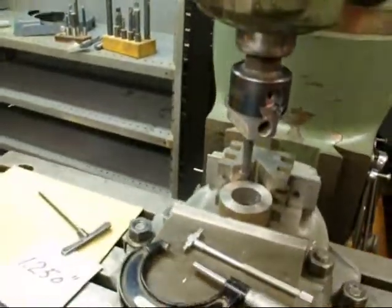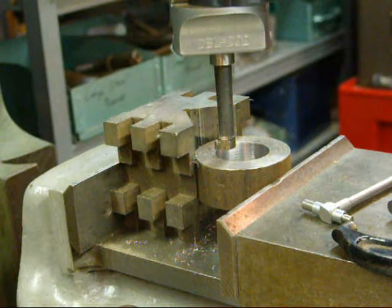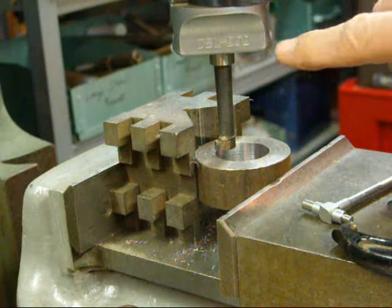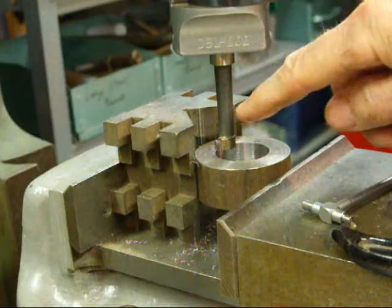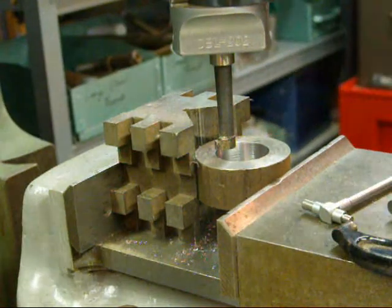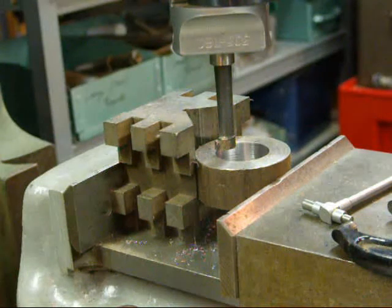I've got to set the camera on the tripod. I've got my safety glasses on and I'm ready to bore. I've set the boring bar for about a ten thousandths feed. I already took one initial cut to make sure it was all set up right. We'll turn the machine on and here we go for our first pass.